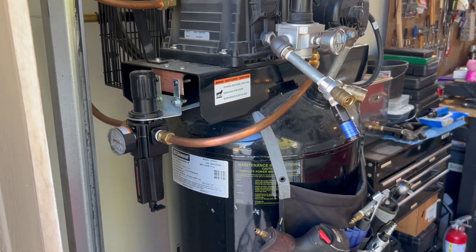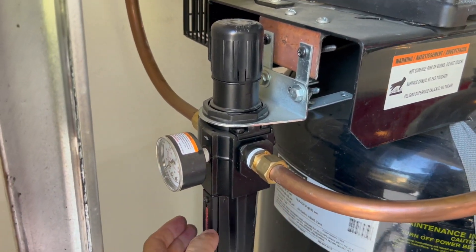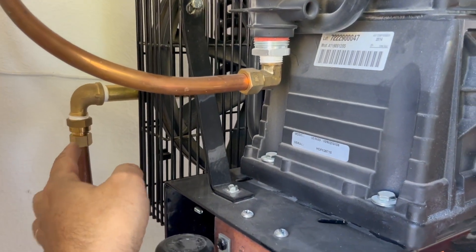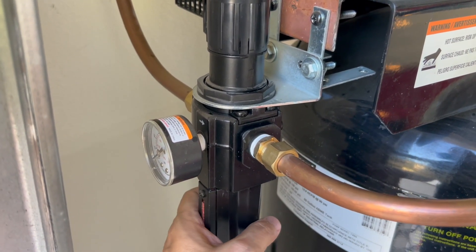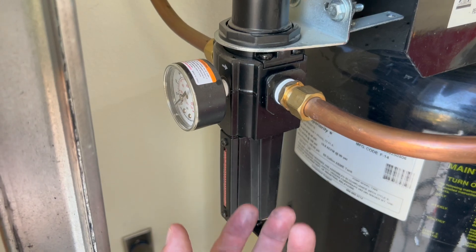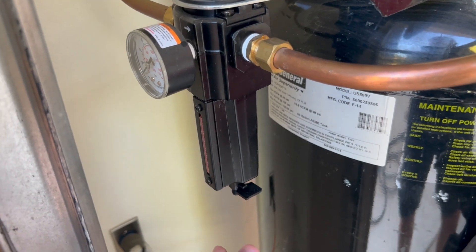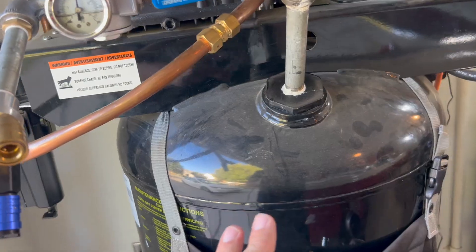The way this is designed, there is a water trap here. As this hot air is cooled and comes through this pipe, it goes into the water separator where, because of the cooler temperature, the moisture will drop out. The droplets collect in here and once we let this cool down we can drain it. This is where all the moisture goes — very little if any gets into the tank.